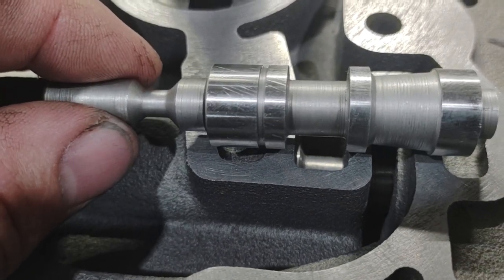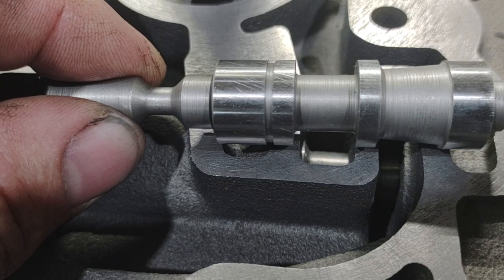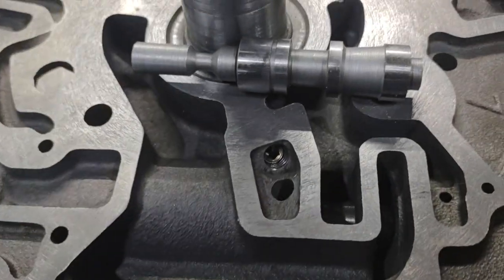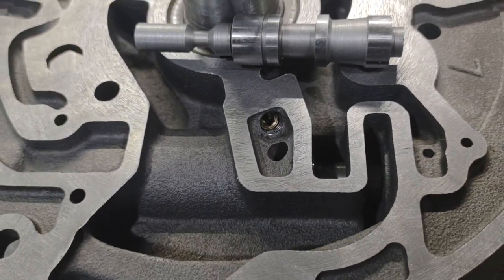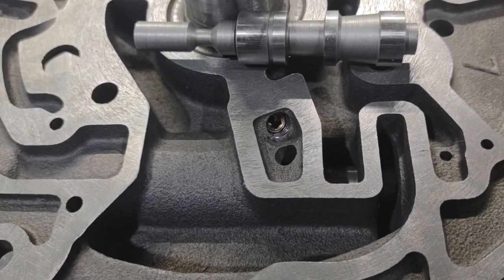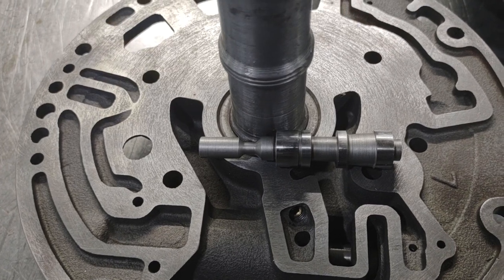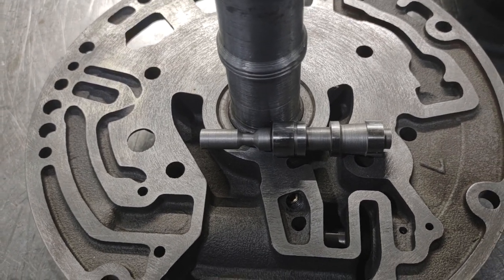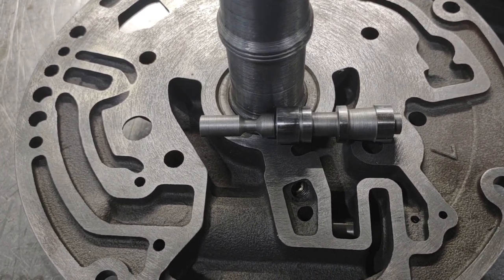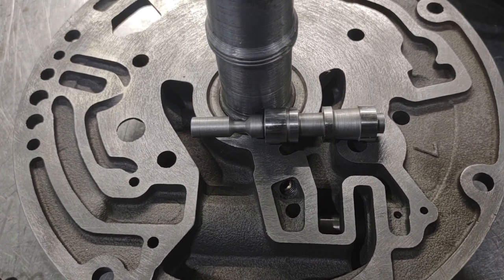That's basically how the pressure regulator valve works — it has to open to relieve pressure back to the suction or sump of the hydraulic system. The design doesn't change much on any piece of hydraulic equipment. For example, the two and four post lifts you use in the shop — the pump motor has a pressure regulator very similar to this in the block on the motor to regulate the pressure, and it's adjusted to limit the amount of weight the lift can lift. That's why they're rated about nine or ten thousand pounds — they tune the pump to a setting that matches the structural strength of the lift.